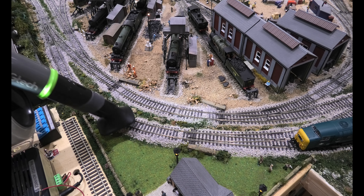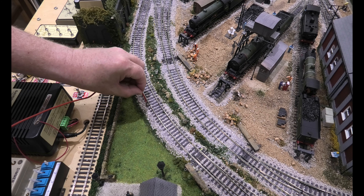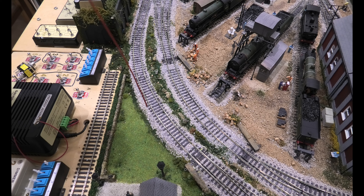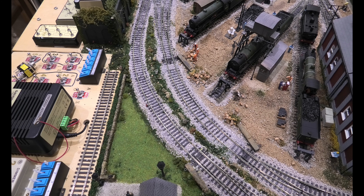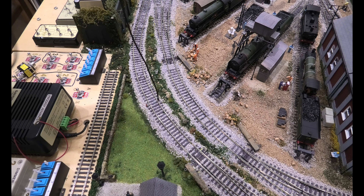We'll check if our holes are big enough for the wires. We've previously hoovered up the drilling debris so we can just push them through — and there we go. When drilling down, be careful you're not drilling into other wires. Keep pulling the wires through and make sure the black and red are the right way around — keep everything uniform.